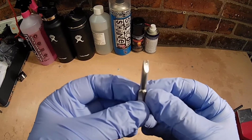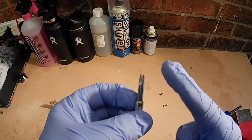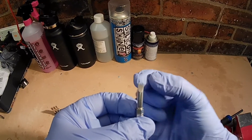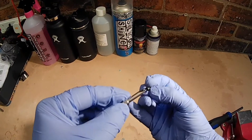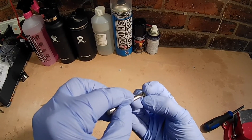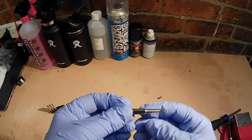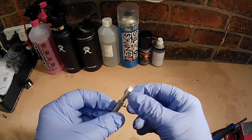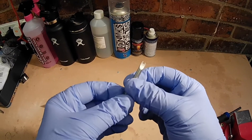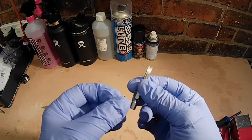I've actually had to chamfer each corner to make the tips or nibs of this bit small enough so it actually fits into the cap screw. It doesn't take much doing — I literally just put it in the vice and used a metal file to file the ends off. It is hardened, it's actually chrome vanadium I think, but it literally took a couple of minutes just to chamfer that off.